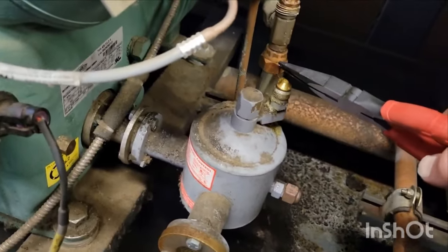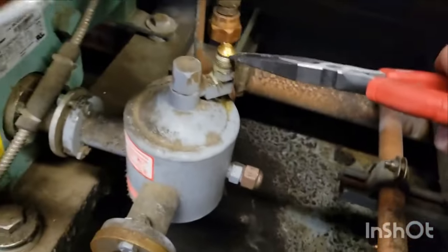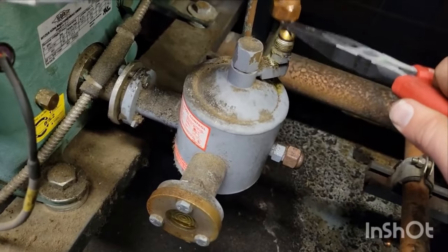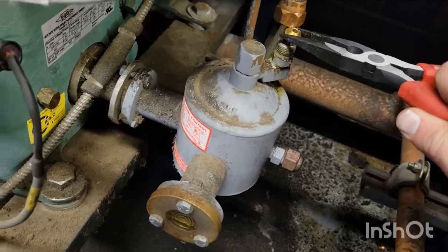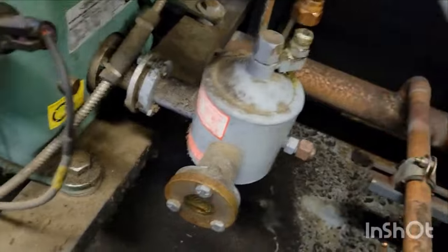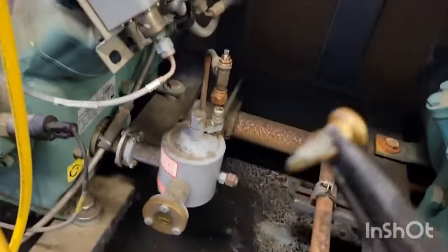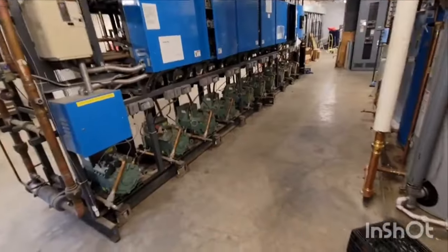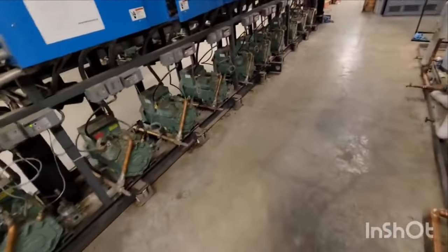So, shifting this off of there, and that little brass fitting on top comes right off, comes right up. Just a screen, kind of a pain to do with one hand. You see? And you just hold it up to the light, and if it's black, it's dirty, and if you can see through it, it's okay. But typically this wouldn't cause a rack failure. This would cause one specific compressor to trip on oil. Just wanted to throw this in there to interject it, okay?